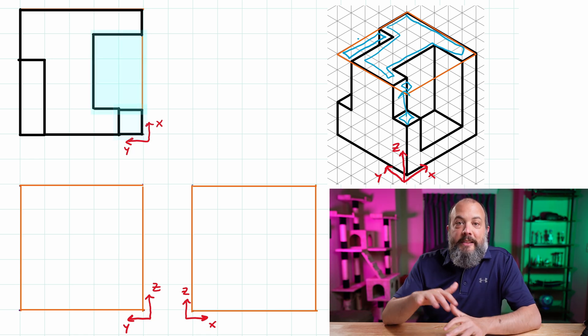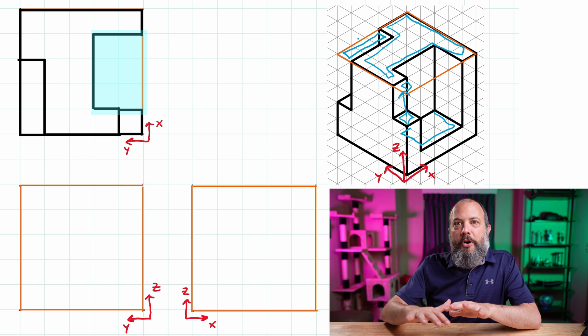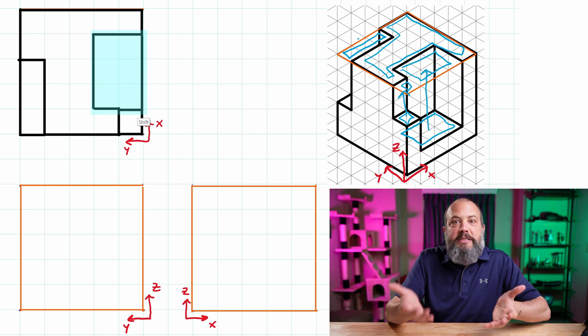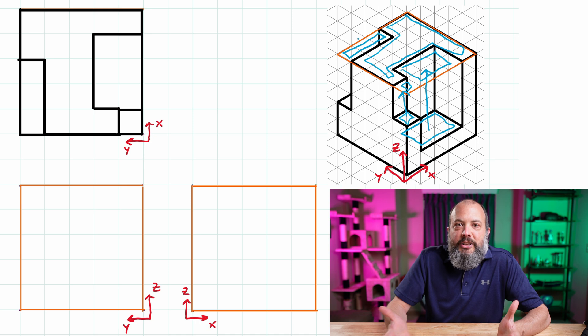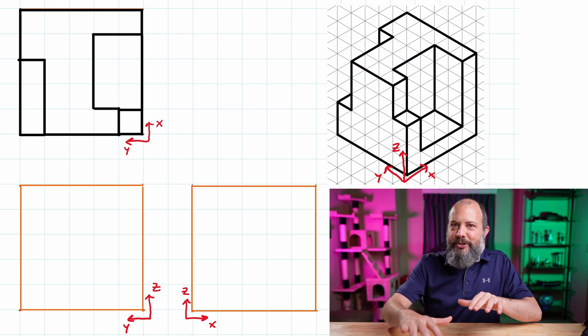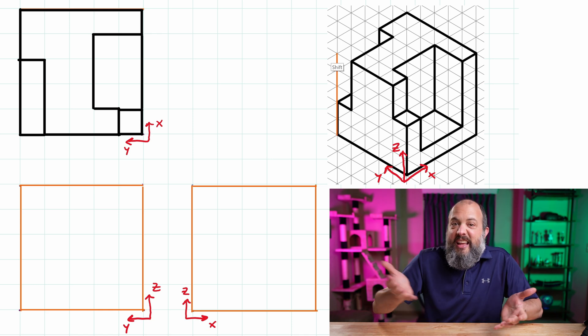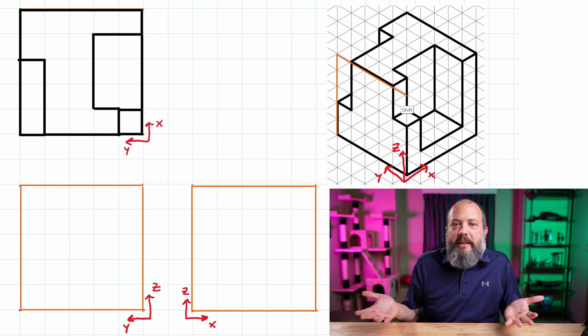All the way down towards the bottom of the part on the right-hand side is a big wide flat section that fills in the rest of the top view. Checking for hidden lines, I'm looking for anything that is horizontal but would not be visible from the top — that is, underneath something else. In this drawing there's nothing like that, so the top view is done.